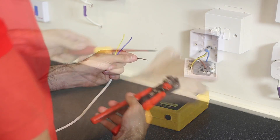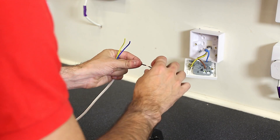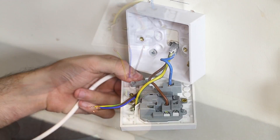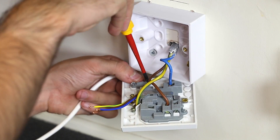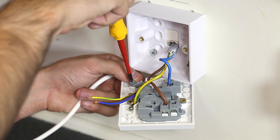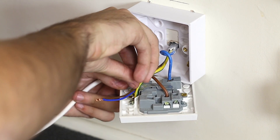Then, uncoil and strip the cable. When stripping the cable, use a wire stripper and ensure the conductor is not damaged. Next, wire the cable into the correct connection by simply twisting and folding it before inserting. Please ensure the external copper conductor is not visible. Use the correct size screwdriver and ensure a tight connection.